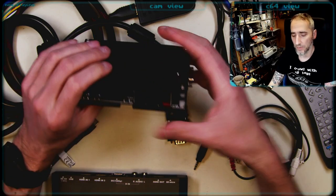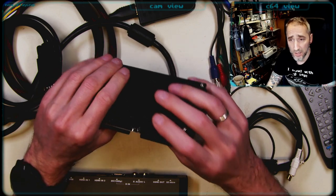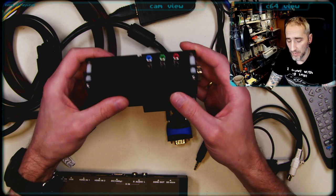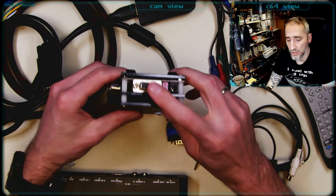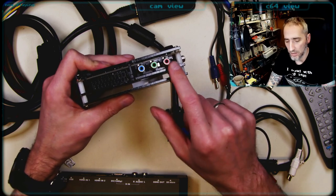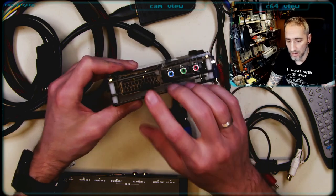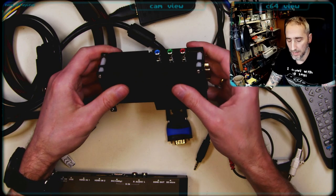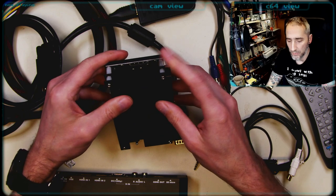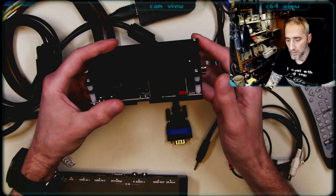Coming to the OSSC, the world becomes a little bit more difficult because the OSSC has basically no standard analog to HDMI conversion. It requires either YPbPr or VGA input. And YPbPr is available on those cinch sockets as well as on the SCART connector. And you have to feed in audio as well, since only SCART is capable of receiving audio. And therefore you have additional sockets on this side, which is basically the output side. And here you can feed in an audio signal, and then you have your video signal complete.